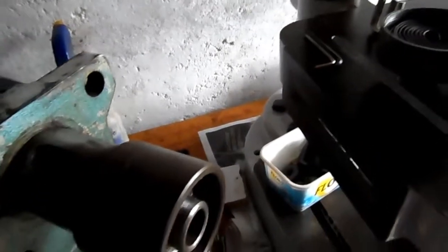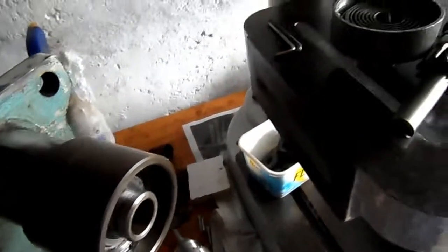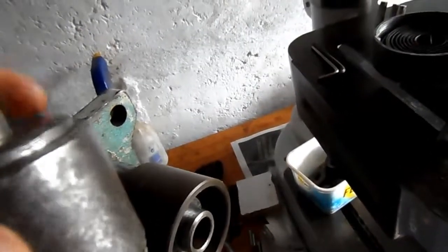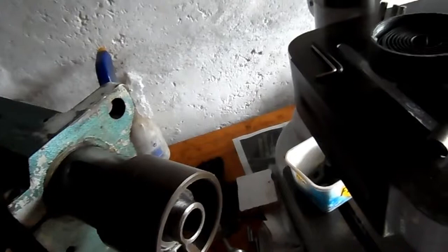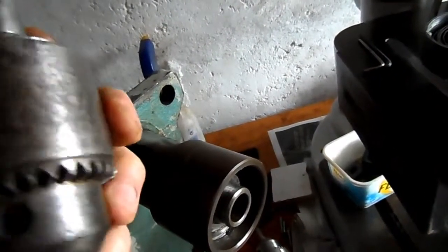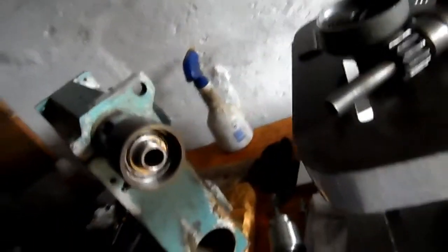So it's a simple tool and easy to use, and you know the drill, it just pops off and it doesn't do any damage to the drill. And obviously what's happened to you is they haven't had a Morse taper, or they, like me, have lost it, and they've just come in about it with a mallet or a hammer and possibly bent it or damaged the mechanism, and certainly damaged the chuck body. So that's not the way to do it, folks. Right,